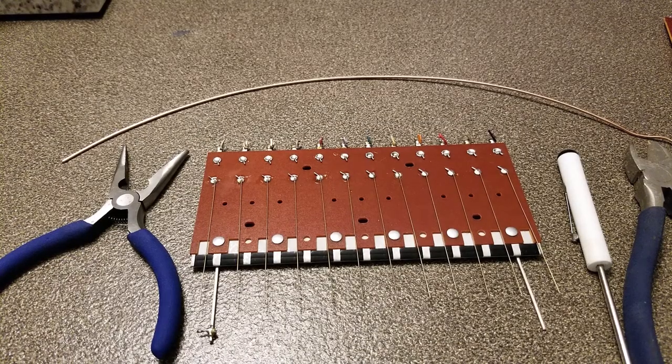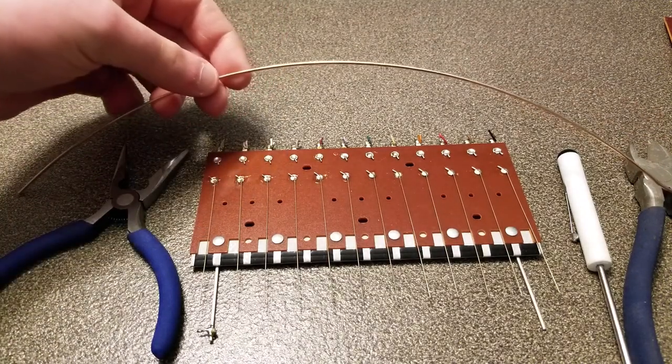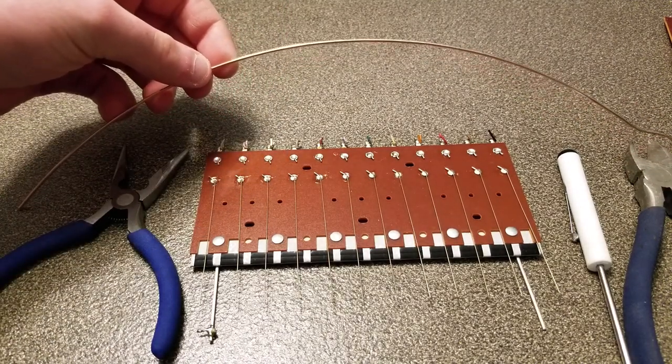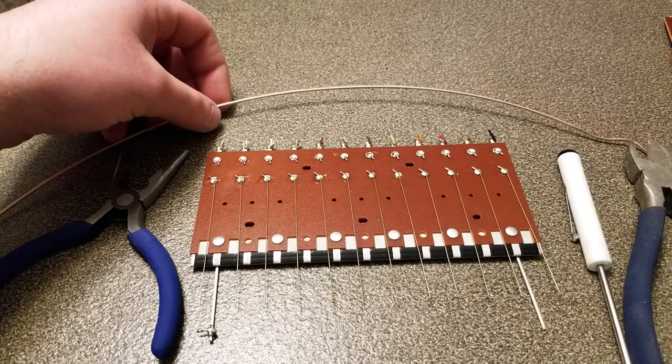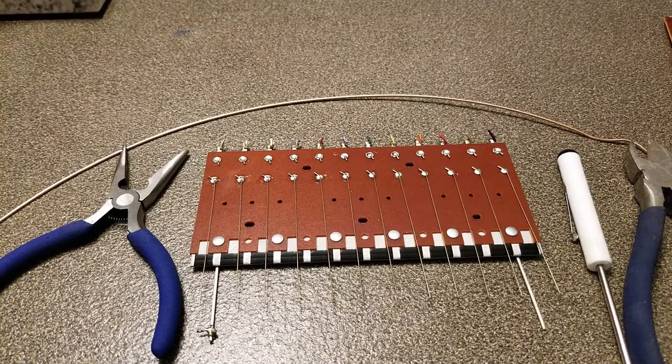Unfortunately, the vast majority of the key switches in this and many other Baldwin instruments are of the elastomer variety. There's an easy way to get around this though. All you need is a standard piece of ground wire that you would find in 14 American wire gauge wire — essentially the stuff in your walls used for standard circuits. You can just go to the store and buy some NMD-90, or if you're in the US, NMB. Strip the vinyl sheathing off and use the ground wire.